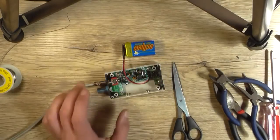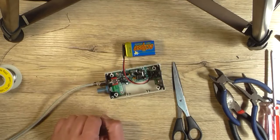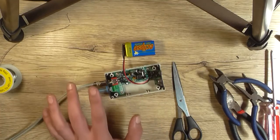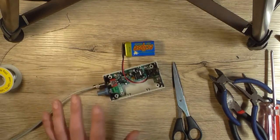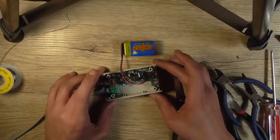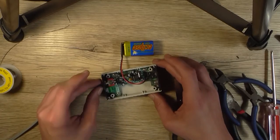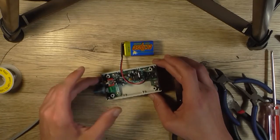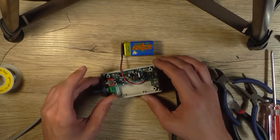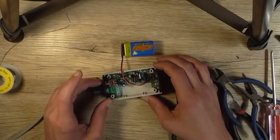Alright, this is what the sound quality is off of the unit here on the desk going into the interface. There is a bit of a buzz. That's not actually present with the headphones normally plugged in. But as we can hear, it's pretty loud. If I put my finger on the lead, it grounds it properly and the noise goes away. How nice. So I'll keep my finger there.